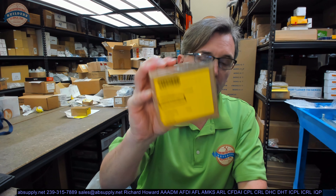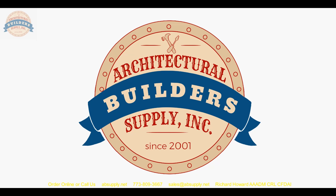This box will also contain some cardboard shims — handy not only as packing material to insulate hinges from each other during shipping, but if you need to shim the door opening, you can use those cardboard shims. Stanley also has a line of pivots and wardrobe pivots we keep in stock: the 341, the 327, and similar part numbers found in that catalog. Any questions on the FBB179, 3.5 by 3, in a US-3 finish — US-3 means polished brass, though it would be more accurate to call it 632 finish, meaning steel-based polished brass finish — please feel free to reach out. Thank you for watching; if you've enjoyed this video, please click thumbs up, subscribe, and maybe even send the video to someone you know.